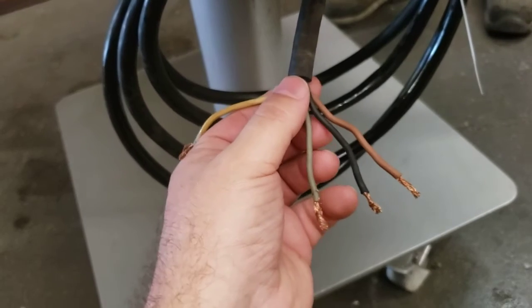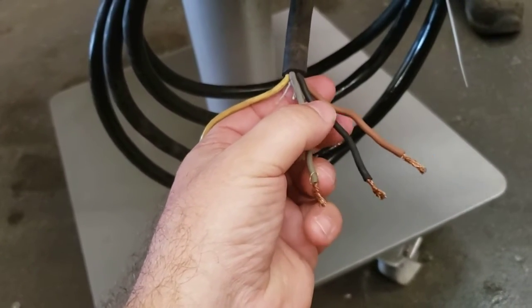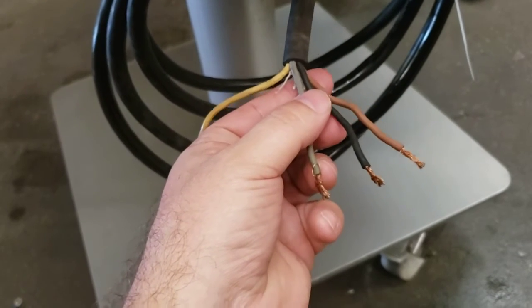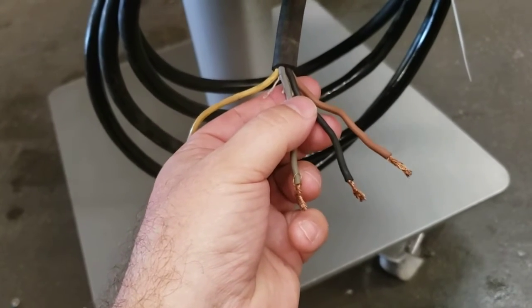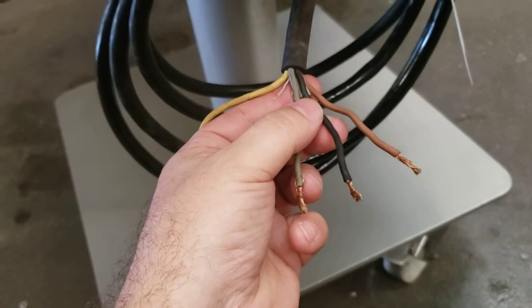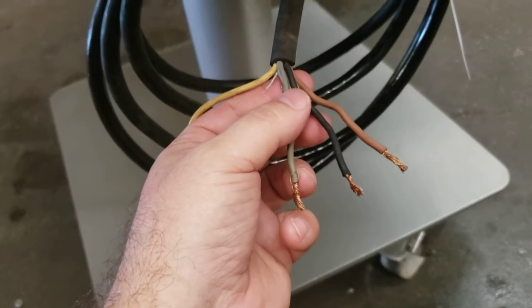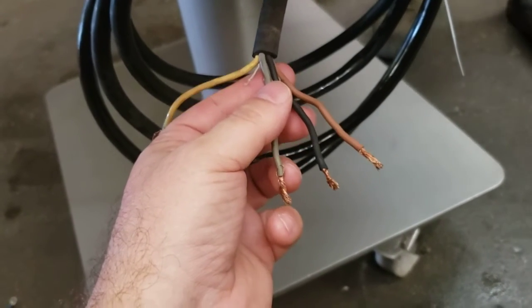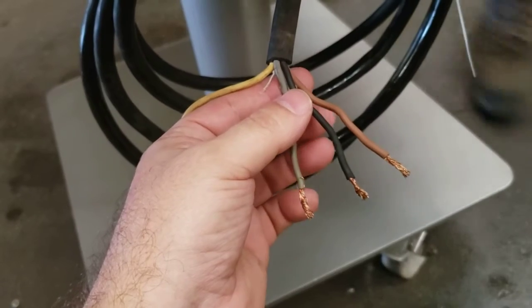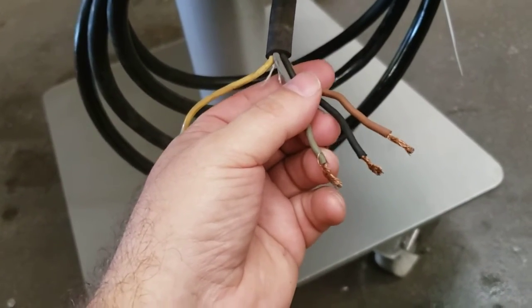When you plug in the machine, when you wire the plug, your electrician should know that if it's not working as soon as you start the machine, and you're going to do that for a couple of seconds, don't try to run the machine when it's not working. There's a safety in the machine that will not let it work. And if you notice that, you have to reverse one of these 3 plugs. Your electrician should know what that means.